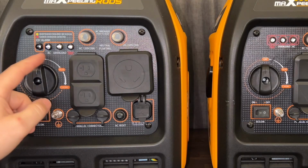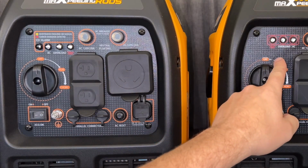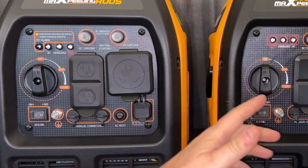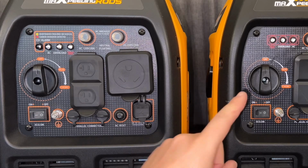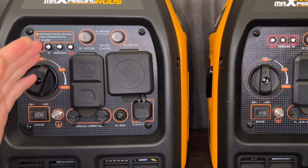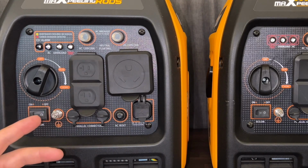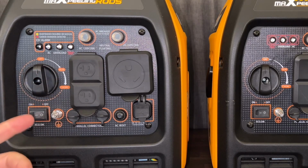When we take a look at the selector dial, it says off, run, and choke, and it doesn't really have a position except for here, where this is actually where you'll have your fuel shutoff. And I actually made a video about this, and I'll have it in a link down in the description below so you guys can watch that and see how it functions. That way, when you put it in this position, it'll actually run the generator until the carburetor is out of gas, and then the generator will just shut off on its own. So be sure to watch that video.